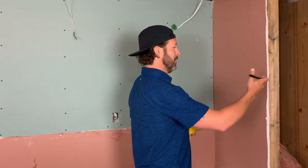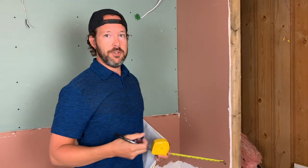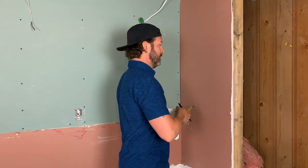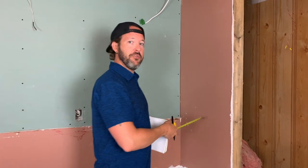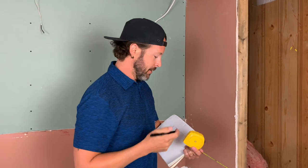One of the things you need to remember when you're measuring a kitchen is whether there is gyproc or no gyproc on the space that you're measuring. It's always good to add that in mentally and on your paper. For this space, there's no gyproc and my measurement is 24 inches, so I'm going to add a half inch for that gyproc so that I don't miss it when it comes time to design this kitchen.